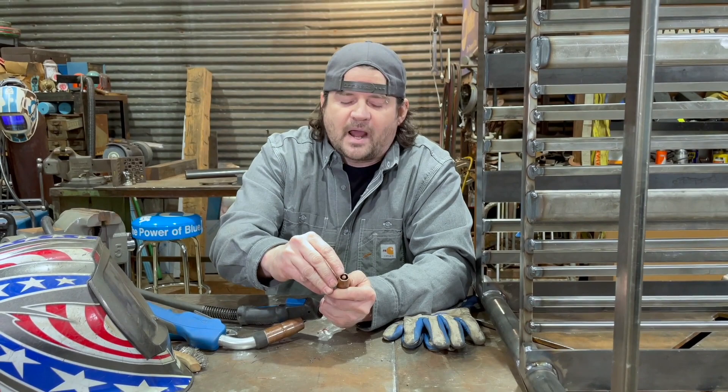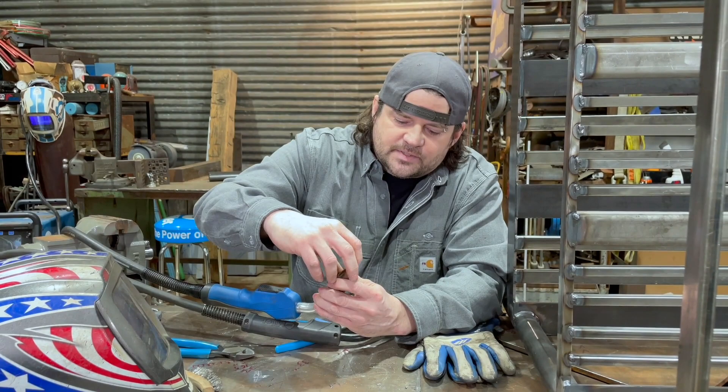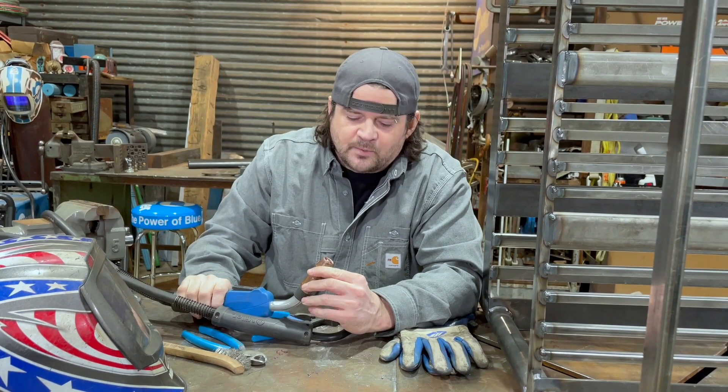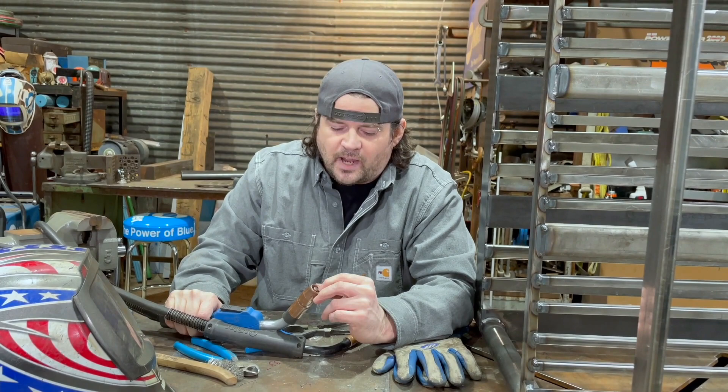It also depends on what you're welding. If you're doing pulse aluminum, the tip will just start frosting up with aluminum and you don't even need to scrape it off with a wire clipper — you can just take a wire brush and scrape it off. Pretty much between every pass I would take it apart and clean it, because otherwise it was really fickle and the aluminum was catching on the debris on the outside there.